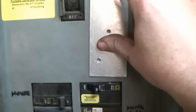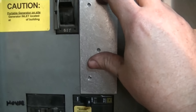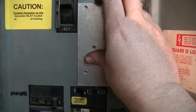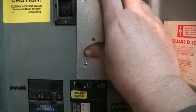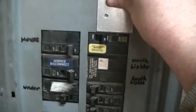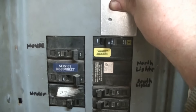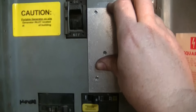The next thing I need to do is here is the plate for the interlock switch. I got it mounted just like so, mark my holes, and then take the panel cover off, drill the holes out, and put this back on. While I'm in there I'm also going to put my zip ties — you're supposed to zip tie it to the breaker next to it. So I'm going to go ahead and do that when I have it off.